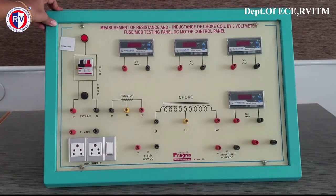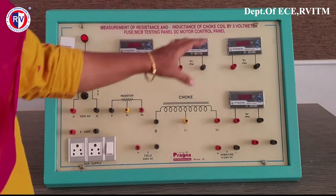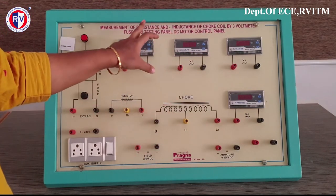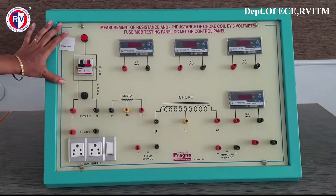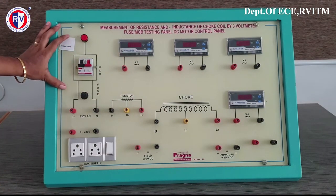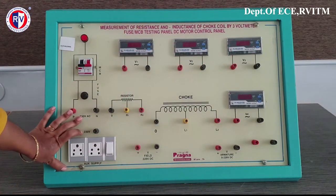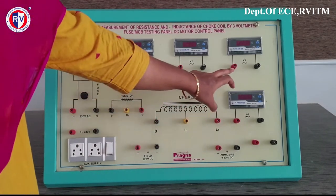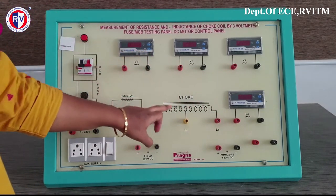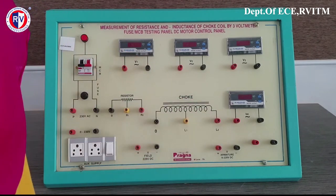The small explanation for this experiment: you can measure the resistance as well as inductance of a choke coil. The choke coil is a combination of both resistance and inductance. The important parameters which you will tabulate are the voltmeter readings V1, V2 and V3. When the supply voltage is given, the current starts flowing, and then you can take down all 3 voltmeter readings — which are across the choke coil and the resistor — and finally the ammeter reading.